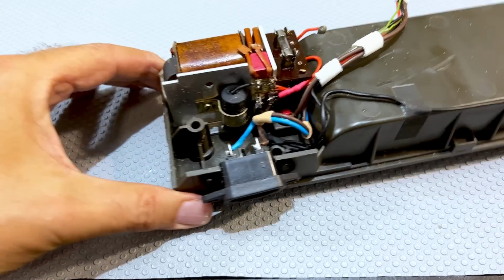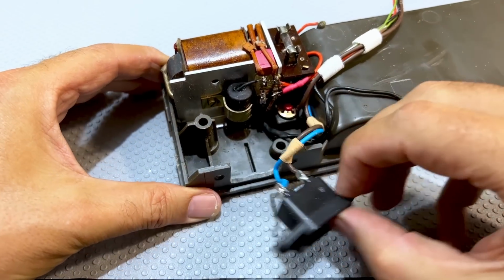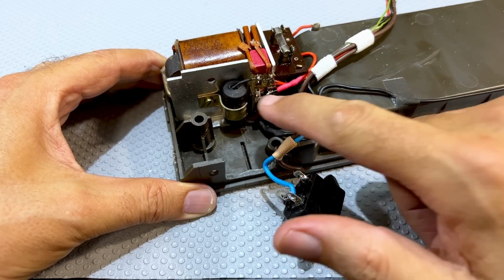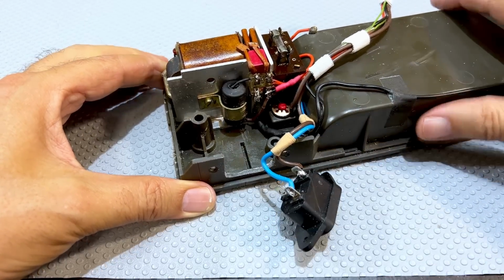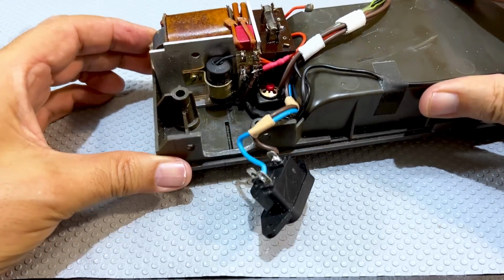Someone really, really messed this up. Well, it's all been redone. As you can see, I've changed the capacitors. There are two capacitors in here, 1000 microfarads and a 50 microfarad. And there was a Zener there. The Zener's fine. And there was a problem.